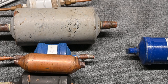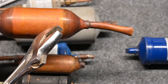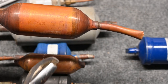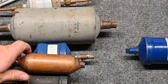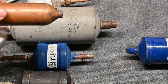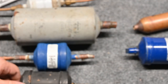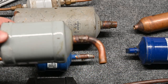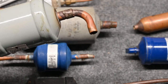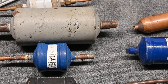How can you tell if somebody put a filter dryer or a muffler on there? A cool little trick: you can get an adjustable wrench — which we all keep in our truck — and tap on the filter dryer or the muffler. You can hear that hollow ring to it; that's how we know it's hollow. If I have my liquid line filter dryer and tap on that, it's a definite thud sound because it's solid inside. So if we tap on the muffler you hear that definite ring to it — that's the difference. It's a good way to know if it's a muffler or filter dryer without reading the words, because the words may be gone.